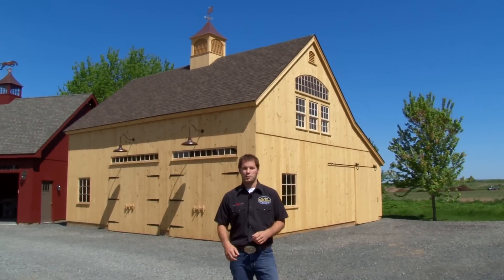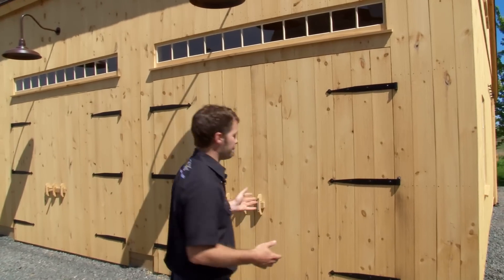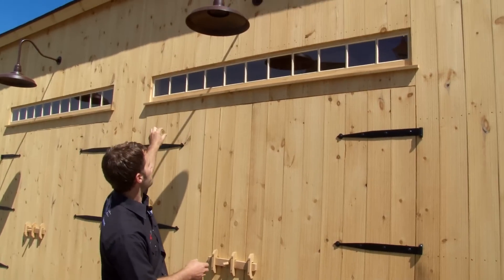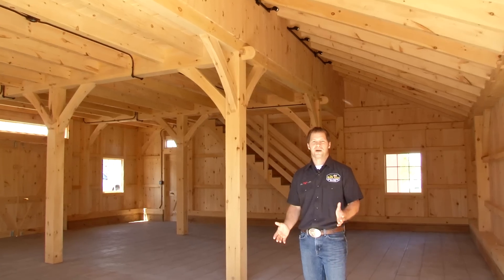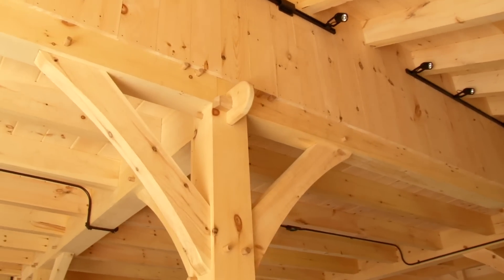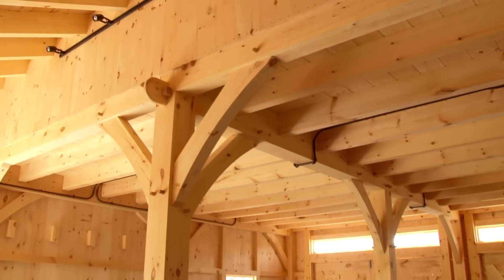The carriage barn is now complete. It took us a week and a half to build and everything is finalized. Everything about this carriage barn is authentic, right down to the details with the doors and the windows — the doors were all handmade by our craftsmen, with authentic oak latches and antique strap hinges and hardware that were hand hammered. You'll remember at the beginning of construction we had 284 pieces and 230 oak pegs. Everything is now complete and in place. I'll focus on this joint — our Dutch anchor beam tenon — you'll see how it finished off with the oak wedges and the through mortise with the curve that was precisely cut with our CNC timber machine.